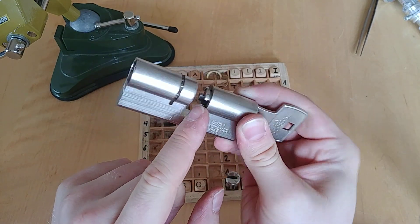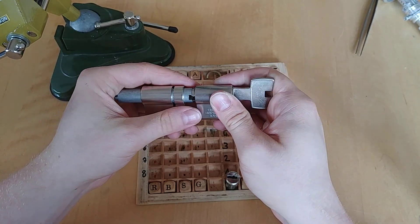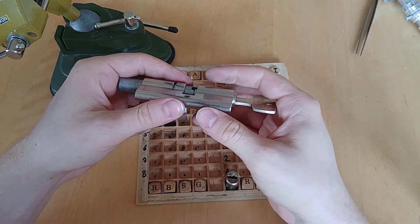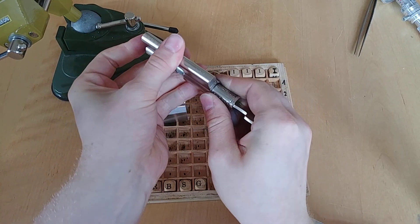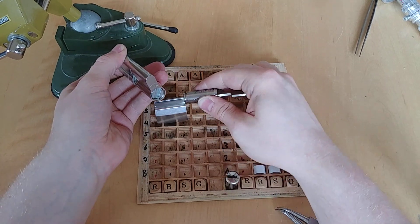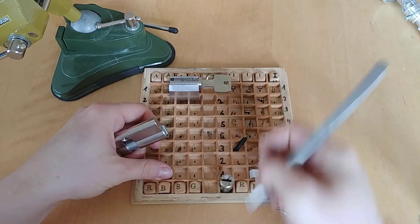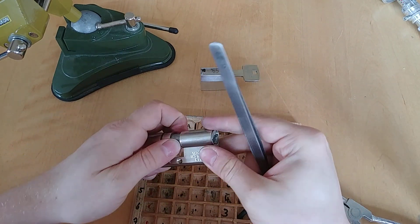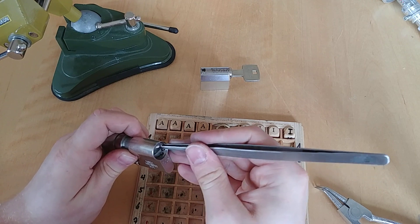So we have also here the full C, so we have nothing — we have the lowest risk. It's not zero risk, but it's the lowest risk of getting something caught. So now we know we have the pins here and the passive pins at the bottom. We turn everything like this so it should not fall out, then we push the follower through. So now we have everything in here — the passive pins here and the key pins there. Let's put this in here and now let's get all the passives and all the drivers out. Because the core is so long, I have to turn it here and pull it, so let's just orient everything in here.